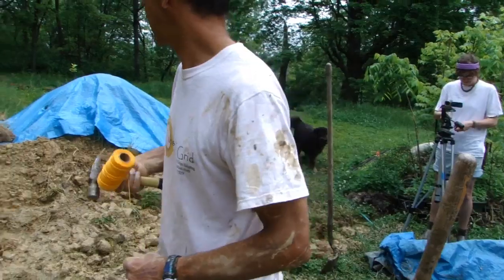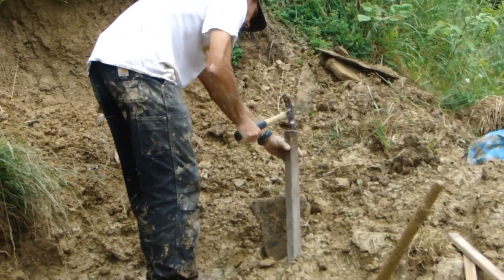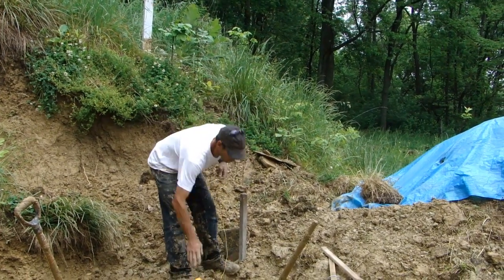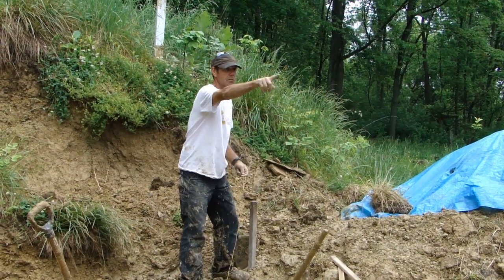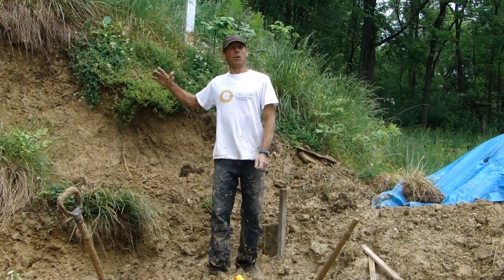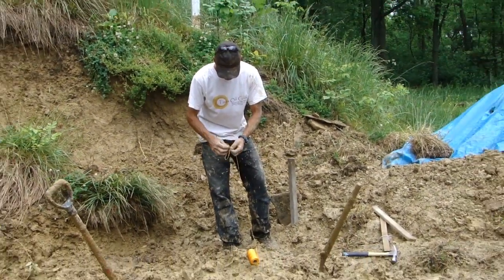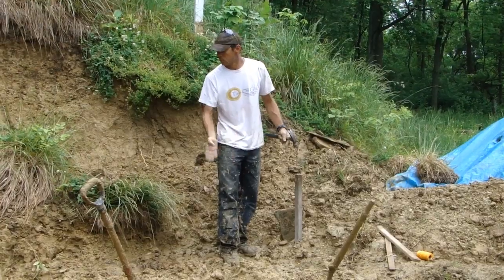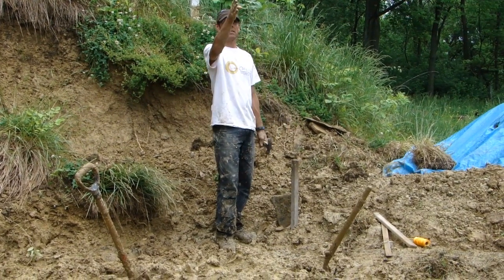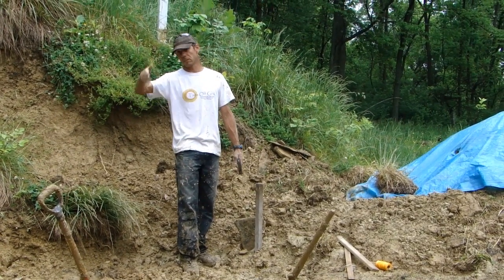The point is that the first stake, you just arbitrarily pick a point — it's pretty arbitrary. But I'm also looking at where the walls are going to wing out, and we don't want to constrict the pathway too much there. We don't want to spend our whole day digging out this cliff side. So I'm making those considerations right now. And then what I'm going to try to do is get this other back stake so this back line is going to be perpendicular to south.